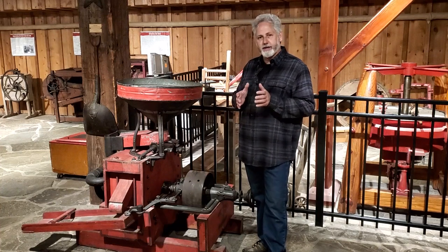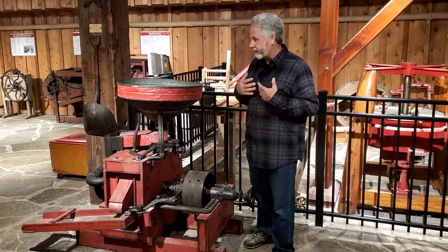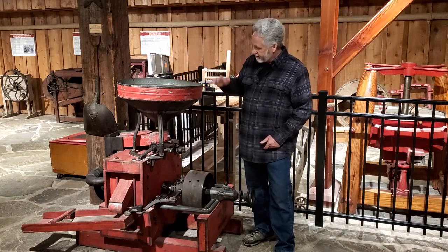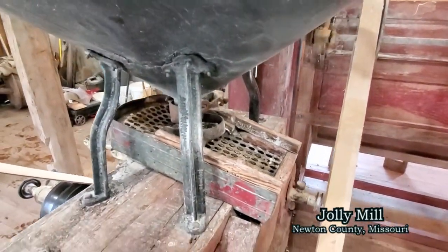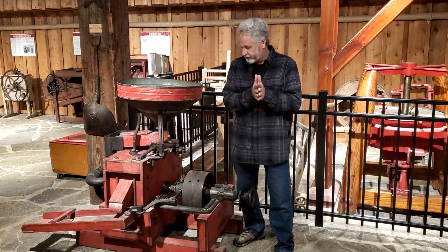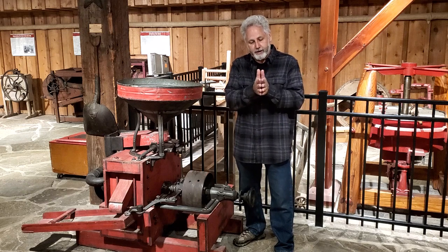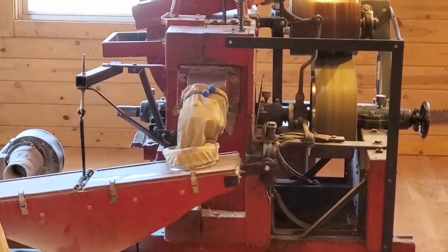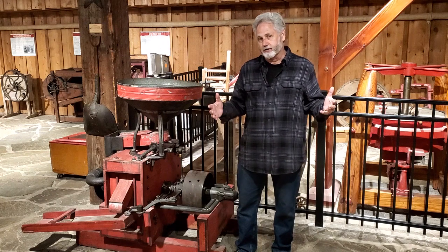This is a vertical grinding stone. I have one of these in my personal collection — mine is a meadows, very similar to this. The pulley is how this is powered, with a belt going up to the main pulley system in the mill, so this operates under water power. You put your cleaned kernels in here, and this thing shakes, keeping everything moving through the different sifter screens inside. From there it drops down into the stones — in this case they're vertical. One is stationary and the other turns against it, and how far apart you have them determines how coarse your grind is. It shakes out the front and goes through another set of screens that separates it again according to size.